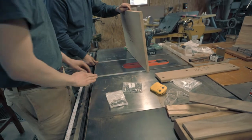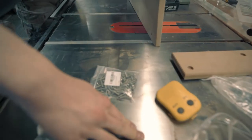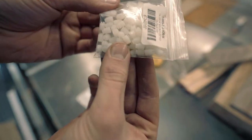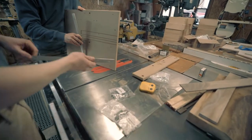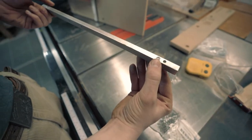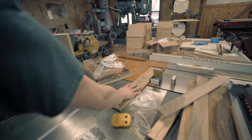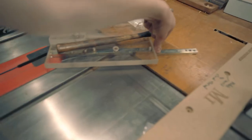Anyways, these are the aluminum tracks, and they work out absolutely super well. No play. Super good. No play because we're using nylon set screws, and we put a couple different nylon set screws in there, and that allows us to make sure there's no play in the tolerance from side to side. I hate that this commercial miter slider that I bought has lots of play, and it's hard to adjust to get no play, but hopefully this will work quite a bit better.